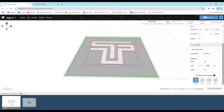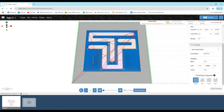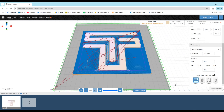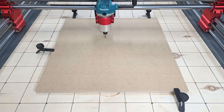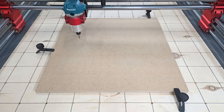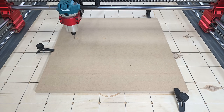After setting the machine up, I imported a 3D model of Two Trees' logo to carve from three-quarter-inch thick MDF, using a quarter-inch two-flute up-cut end mill at the machine's max rated travel speed of 1800mm per minute, or 70 inches per minute, which really isn't great for achieving optimal chip load. Ideally it should be somewhere between 100 and 120 inches per minute to avoid creating a lot of dust or burning the edges. I managed to get good results by adjusting the speed dial on the router to three to keep the RPM below 18,000, and used a 40% step-over with a one-eighth-inch depth of cut per pass. This job took around two and a half hours to finish.